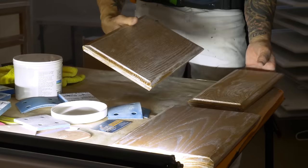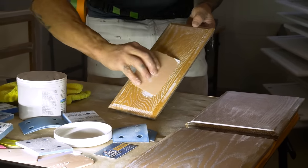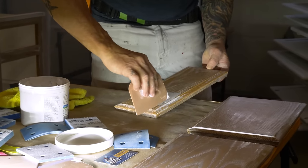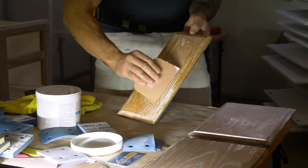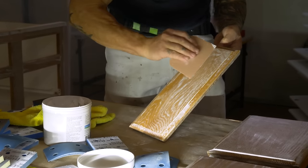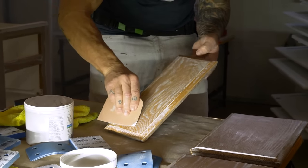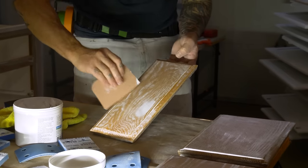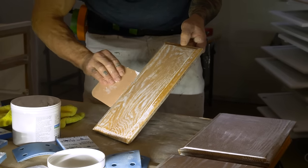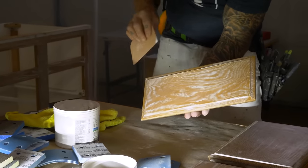And I typically, even on my first coat, am using an inspection light on all my coats all the time, but I didn't do it this time on the first coat because the inspection light messes up our camera lighting and you couldn't see what's going on as well. So I just did it without the inspection light the very first time. It's not as important because you're really just putting aqua coat on the whole door, you've got to get everything covered. But I can see that's looking pretty good there.